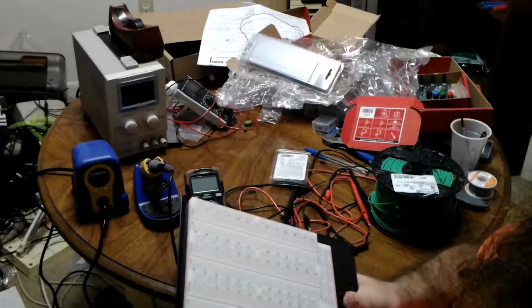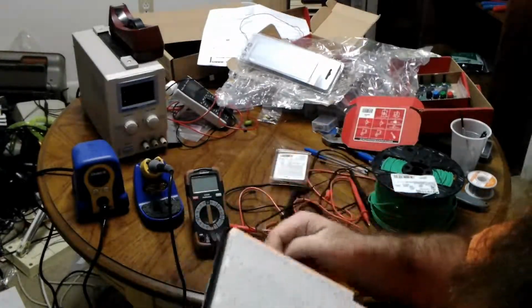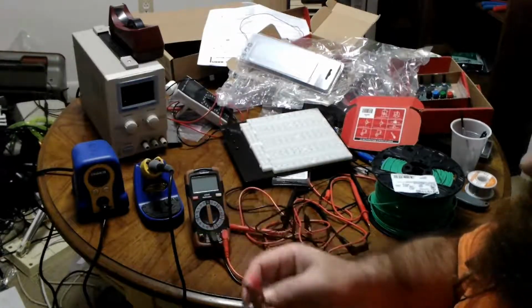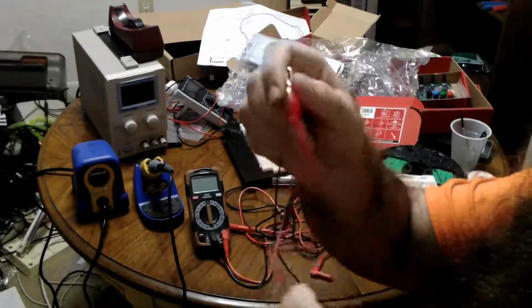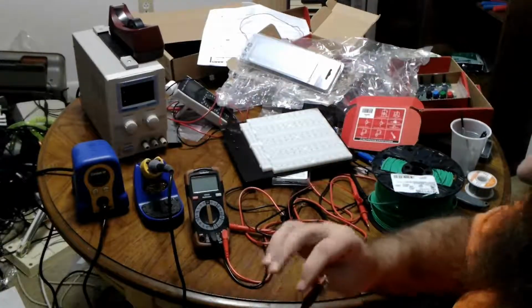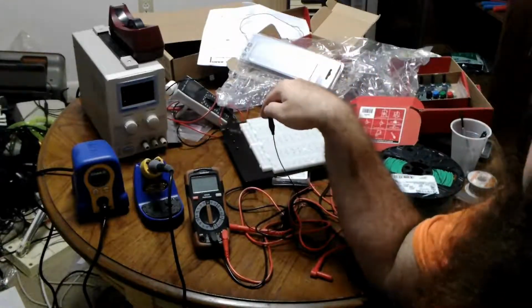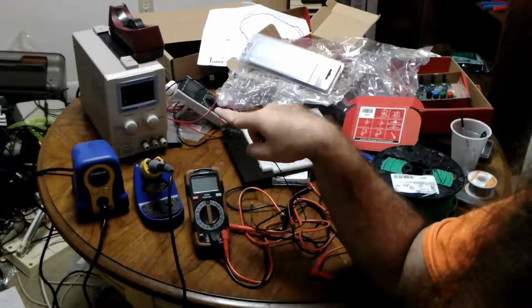So why do I want alligator clips and probes and all this other stuff when I want to put it in a breadboard? But nobody sells bench power supply or multimeter cables for a breadboard. So what I would do is I would just have 2 alligator clips hooked together and then this going into my breadboard. This is a terrible idea. Don't do that. Because frequently I would find that the negative and positive ones were coming very close together and almost shorting across my power supply, which is not terrible because it has current limitation.